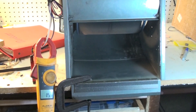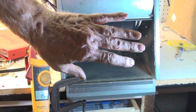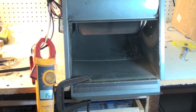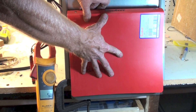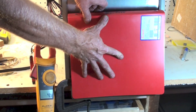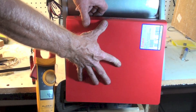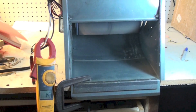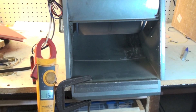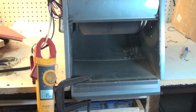We use this when we're talking about duct work. When we're putting these things in duct work, they work against the static pressure. And the more static pressure I put up against it — just like that cover right now — the less it moves and the lower the amp draw. We use this to determine what speed to run our fans, and whether we've got plugged up parts of the duct work. We can tell something about it by the amp draw — it will be lower than normal if there's a restriction of flow.